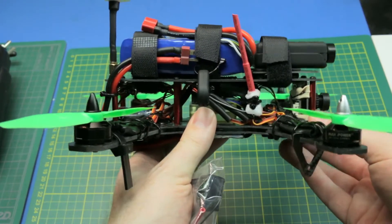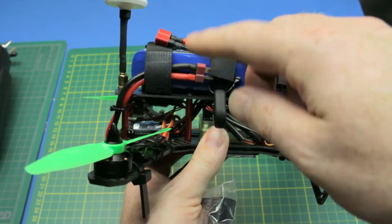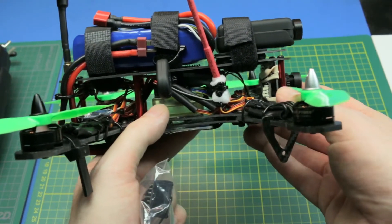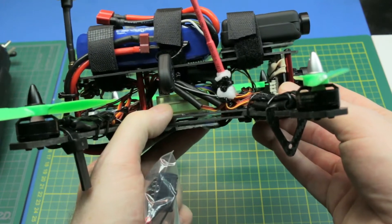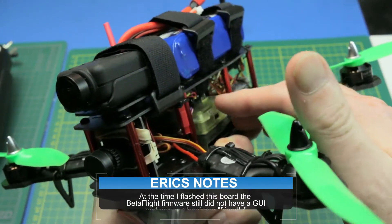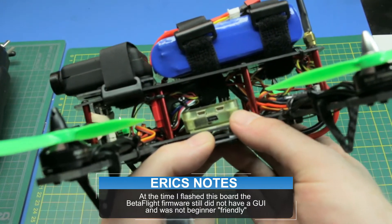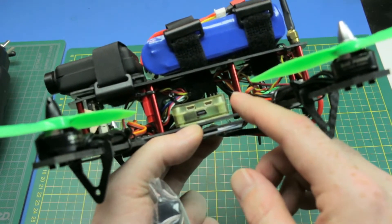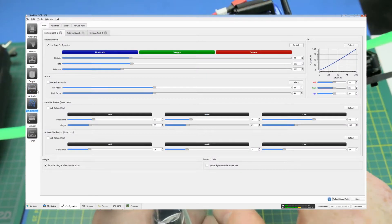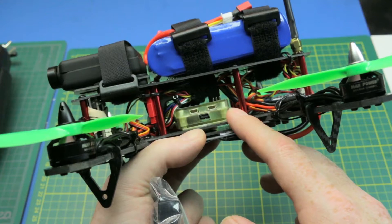The power draw test worked out really well. This thing is not a powerhouse, especially with the large battery on board, but hey it works. I've got a CC3D flight controller on board, and I flashed it with LibrePilot using the Supermoon Eclipse 1509 firmware — that's just the first firmware that comes up when searching around and it's really easy for any beginner to start with. At the end of this video I'll post all my settings and PIDs for anyone who wants them.